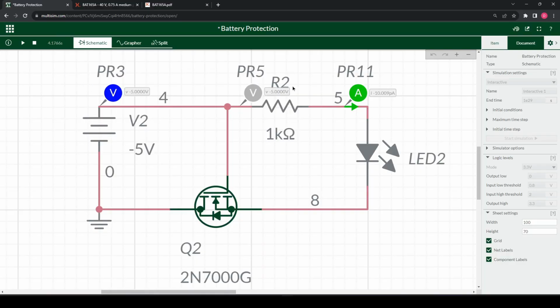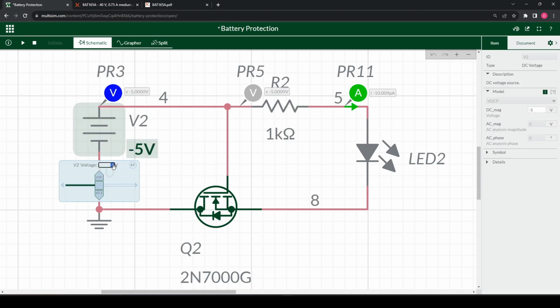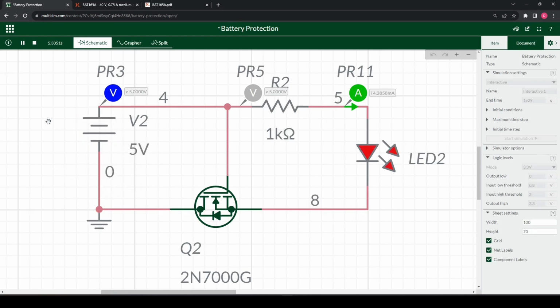Back to our second circuit here, we have an N-channel configuration. So we have an N-channel FET configured on the low side of the circuit, and we're essentially just making the circuit complete, connecting it to ground. So putting in the negative configuration, we have our event. There's nothing, our LED is off. It stays off. Let's apply positive, and you see that our LED is switched on.